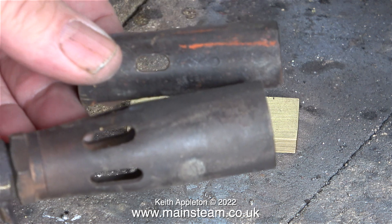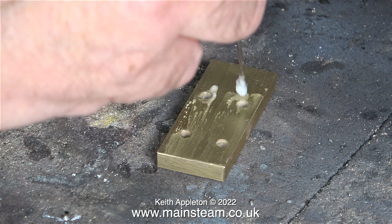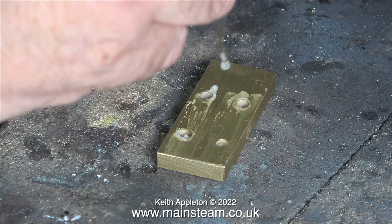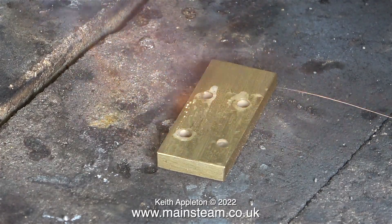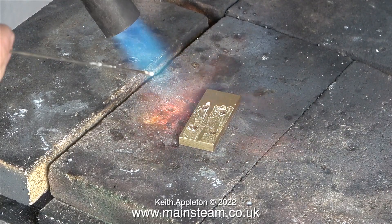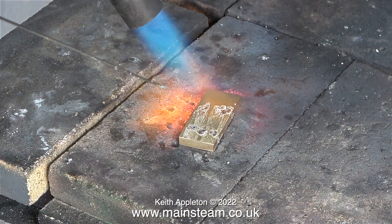You can see how much bigger the burner head I've just fitted is. The small burner head is great for general purpose jobs like piping, but for this job I need a lot more heat. In this clip you can really see how far out of alignment the holes are. The job begins with a generous application of flux — this is Easy-Flo Number Two flux — and the silver solder I'm going to use is called Silver-Flo 55. When I make tutorials about silver soldering I always apply the silver solder too early, and in this clip the camera makes it look like the silver solder rod is in the flame — it isn't, it's just quite nearby.